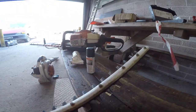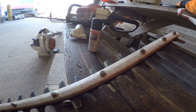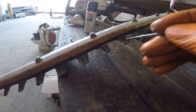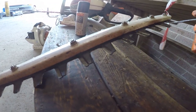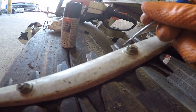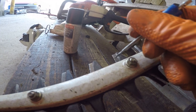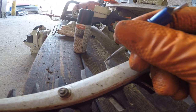And every so often, you need to either change the blades or sharpen them. Because if you don't, they inevitably take damage and they take wear, and they get like this. See, there's a bit missing there. And the edge is uneven. And if you look on these ones, there's a bit missing on that blade and there's a burr. Also here, this should be flat all the way across, but you've actually got a chamfer that's worn onto there. It's where the blades move against each other.